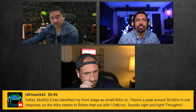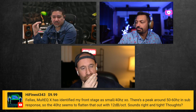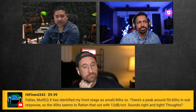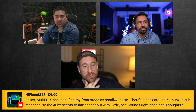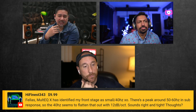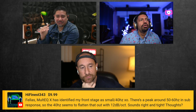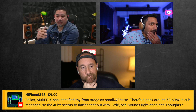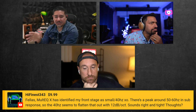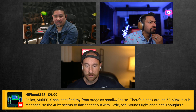That sounds right and tight, but I have to think about it. A 40Hz crossover is pretty low — really low. I hope the speakers can handle that. A lot of times if it has boundary gain, as long as it reads minus 3, minus 6, or minus 10 — whatever they're using — as long as it sees 40Hz, it's going to say it can do 40Hz. It's not testing what happens if you turn it up; it's reference level.